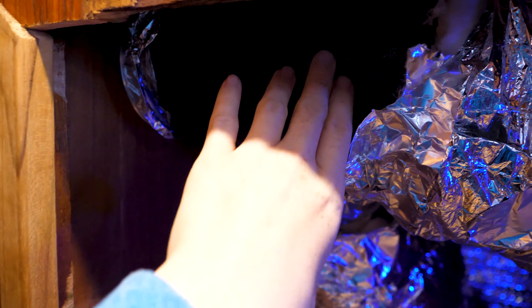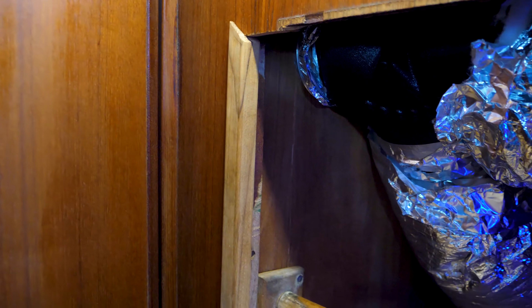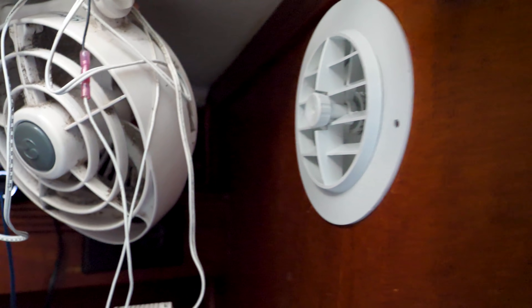On this side there's also a chain plate you can't see. We wanted to keep the vent nowhere near that, because these holes are four and a half inches wide. So we moved it as far to the left as we possibly could to get away from that hidden chain plate. The duct goes through into the closet at the top, and it's kind of behind this area which was dead space, so it didn't impact the ability to move clothing through. It really had no impact on the closet.